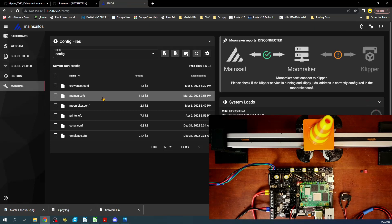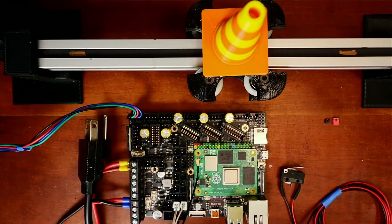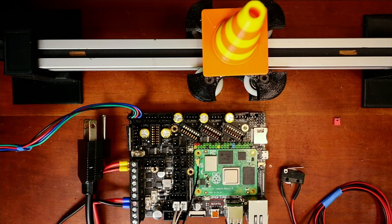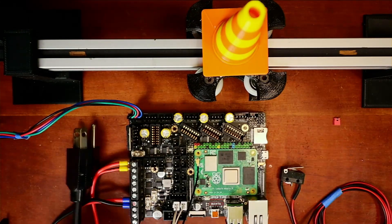We're going to have to make other changes in a moment, but first let me power this down. I've removed the power. Now I'm going to remove the physical end stop and use this very tiny one — this is the end stop cap for the actual sensorless homing. I'll put it on a pair of tweezers and put it in place on the X stepper port, then plug the power back in. It's going to take a moment to boot.